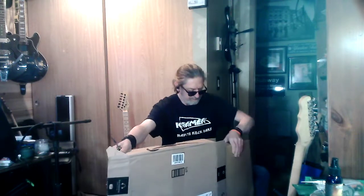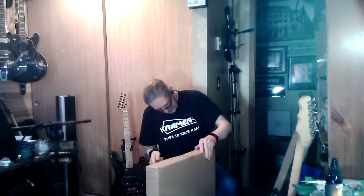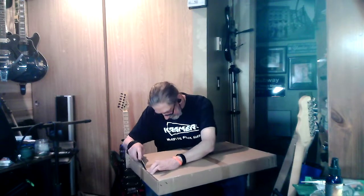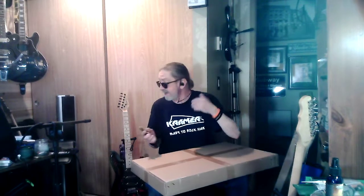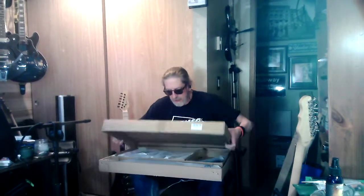It's a box in a box. What I was kind of hoping for — what they didn't say in the description — was whether the humbuckers came with two-wire or four-wire, because what I'd like to do is coil-split the humbuckers. My brain is starting to get a little better and I finally got a new soldering iron, so things are a lot better and I think I might be able to do some funky wiring with this thing.